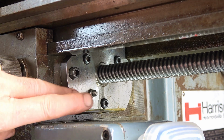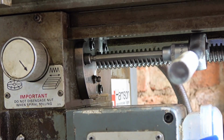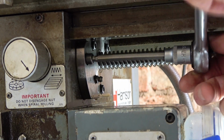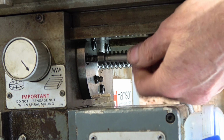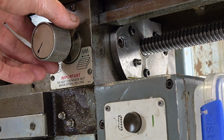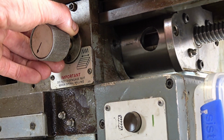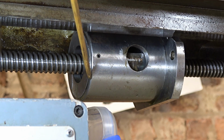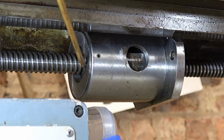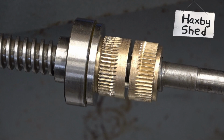So there's just 2 screws holding this assembly in place, this one and the one on the other side. If I pull out this plunger all the way, this table should come to me. I've tightened this ring about 1/8 of a turn, and that's taken out all of the lash. Now that only works because I made a split nut. Refer to previous videos.